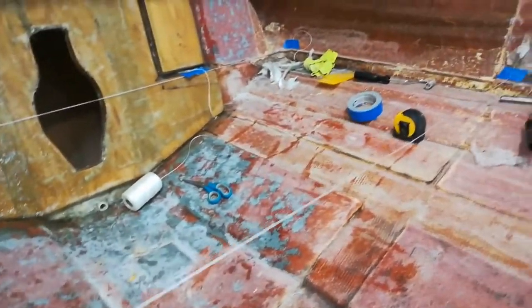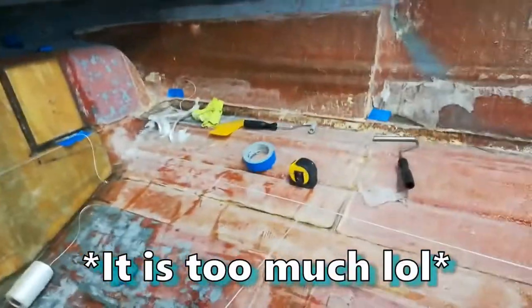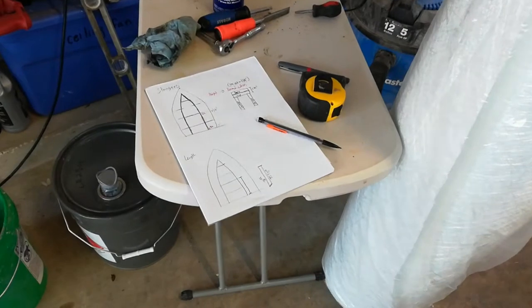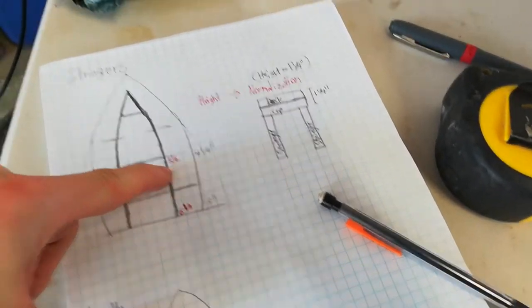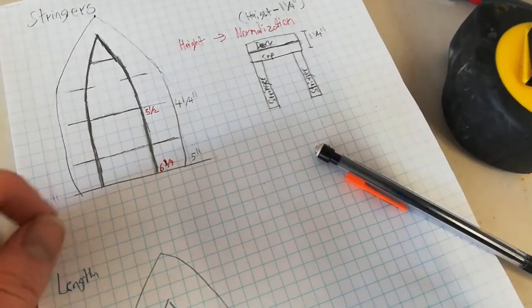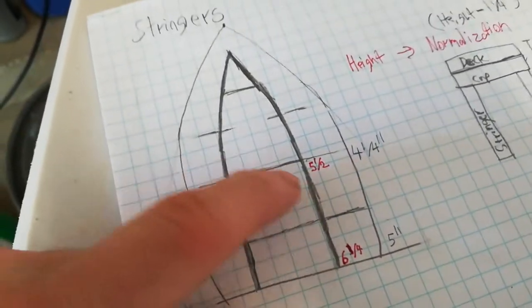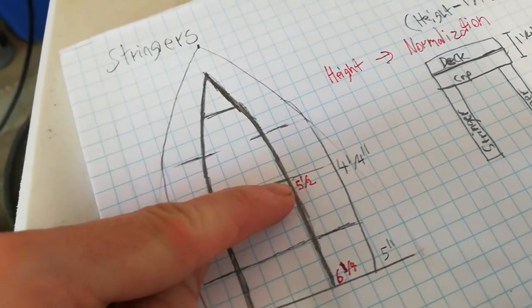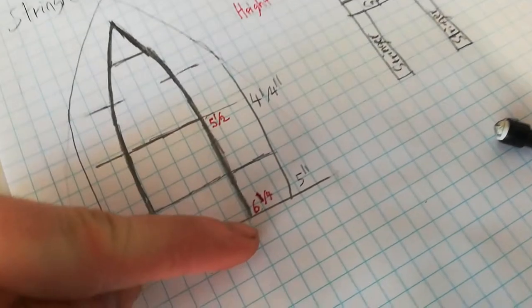You can see it's starting to look like a virtual floor in here. These are probably sagging just a little bit, but not too much. So to start off with I'm going to divide the length of each stringer in half. I already took the measurements for the back right stringer piece for what the deck height is going to be, and I had to normalize those to get it down to what the stringer height needs to be. At the back it's going to be five inches and at the front it's going to be four and a quarter inches.